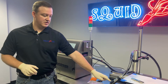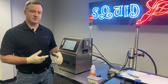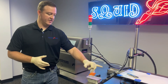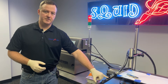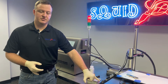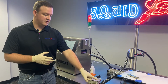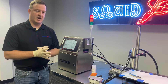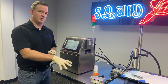The system is going to close the ink valve in the head and just cut that stream off. The hydraulics are still running internally — we have to do that so we can still generate a vacuum in the system. What happens is the ink valve closes and then this bleed valve, or back flush valve, opens. That will apply the vacuum we need to the gun body assembly and to that nozzle. So basically when the inkjet shuts off, you need to be ready to spray solvent directly at the nozzle. This is an automatic process — you have about 20 seconds total.